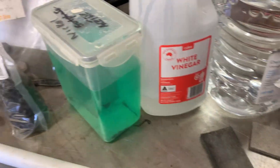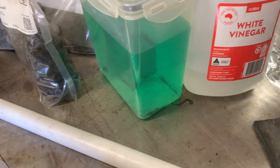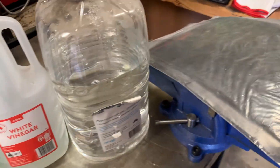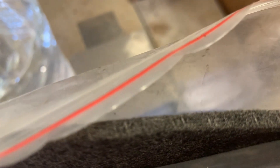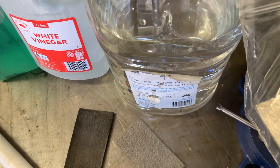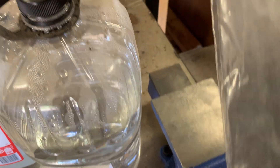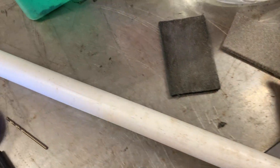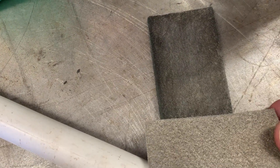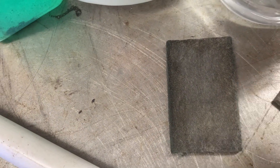Hopefully that clears up a lot of the issues. I just presumed people would look up how to make nickel plating solution when I made the video, and I really didn't discuss that it was welder's carbon felt — it just looks like this. It's 4 or 5 millimeters thick. These are sold on eBay in about A3 sheet size. The difference between contaminated or left-too-long felt versus clean felt: one has a nice clean coating, one has a dirty coating — that probably still works, but I haven't tested it.